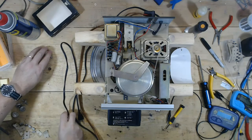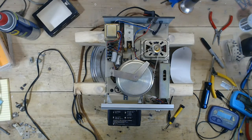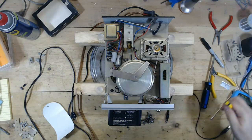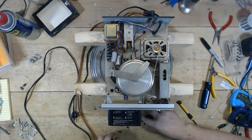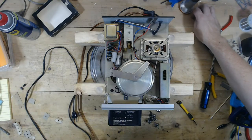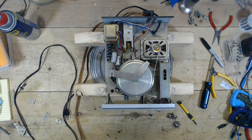After replacing the two capacitors, the one cap that was causing the loss of channel left a noise — like a noisy transistor, white noise. I went through and changed the transistors but that had no effect. I found a one microfarad capacitor up here that was also a problem, and I just went through and recapped the entire board — I wasn't even thinking to shoot it on video. Here are all the transistors I replaced and here are all the capacitors — not a lot of work at all. It sounds good on both channels, no more white noise. I'm going to call this one done and deliver it to the customer. If you like what you see, hit like, hit subscribe, and I'll see you in the next video.